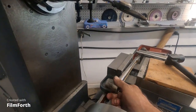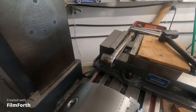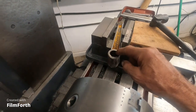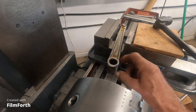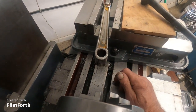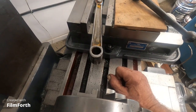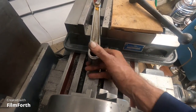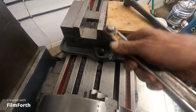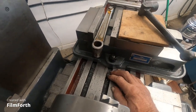I'm going to get this lever in the old vise here and bore this out so I can put an adapter for a seven-eighths round shaft with an eighth-inch key. Then I've got to drill up this end here too and make a handle for that.